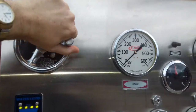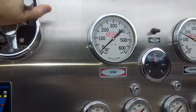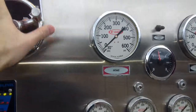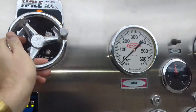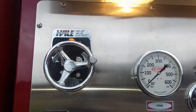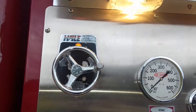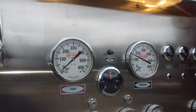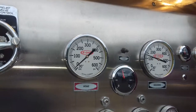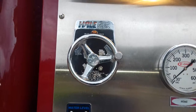One, two, three, four, five — should come on pretty soon — six. About every half turn is 10 pounds. What's happening is water is going from the discharge side back into the suction side. Now when I raise the RPM, it does not go up on the discharge back — the pressure stays down, relief light goes out.